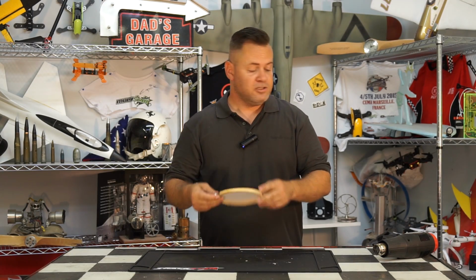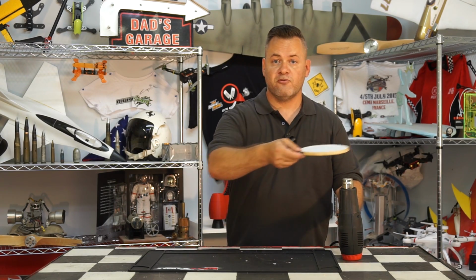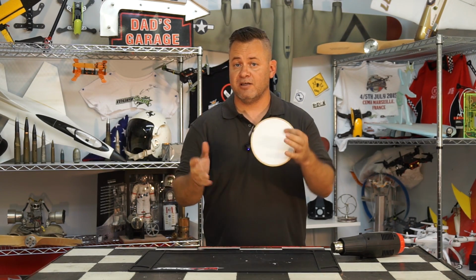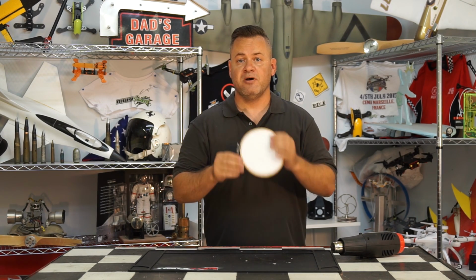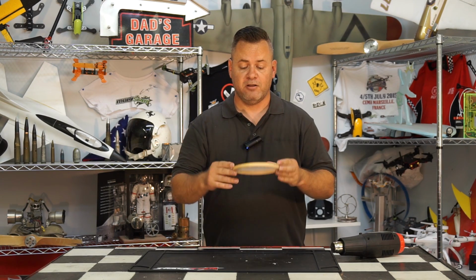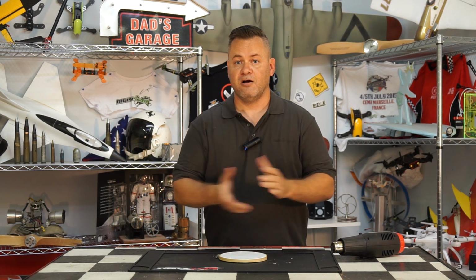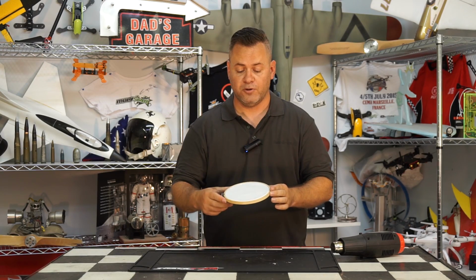Now all we're going to need to do is just take our heat gun or blow dryer, and we're going to work this over it until the plastic is malleable. With polystyrene, normally when it becomes relaxed, you'll see it stretch out and get wavy, and then it'll actually tighten back up. When it tightens back up, then it's ready to vacuum form. We'll have our vacuum form box. All we're going to do is flip on the vacuum. We're going to go straight down with it, and it's going to draw right up around our mold. And hopefully, first shot, we'll have a finished usable little mullet hood.